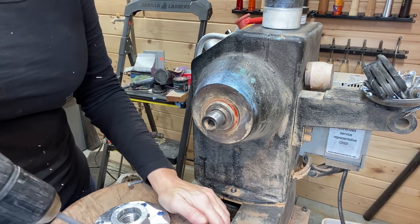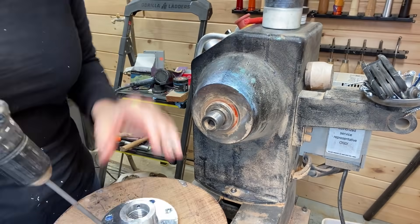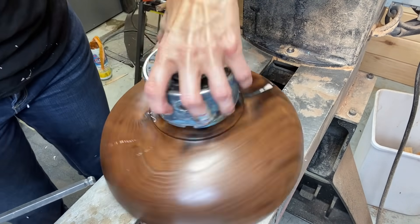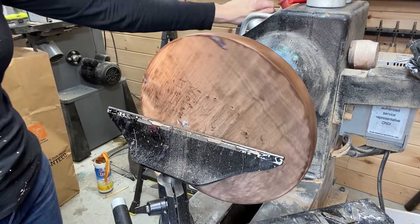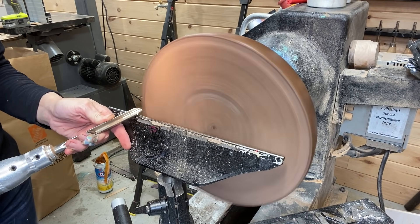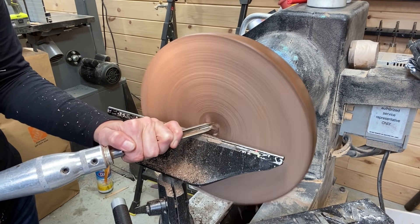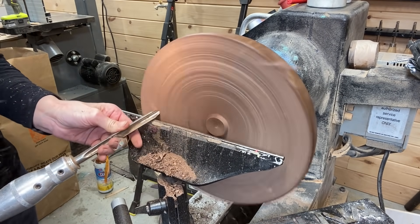I use a bit here to add a small needle hole, removing the faceplate, and will start with the hollowing process in a second. If you've turned walnut before, leave a comment and let me know what you thought. I've turned walnut but usually I have more maple than walnut, and a lot of the walnut I use is for charcuterie or cutting board type things — so I was very happy to get this piece. Making sure it is safe before I start with the bowl gouge. I got the lathe up to about 600, then once balanced up to about 900 to 1000 RPM.